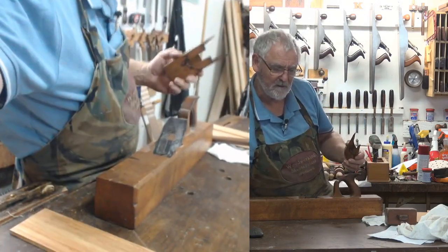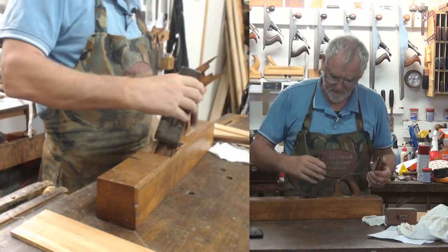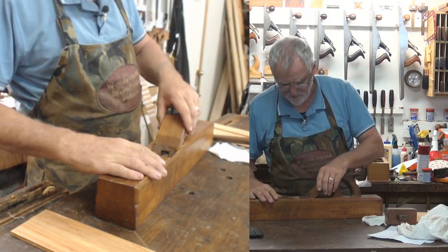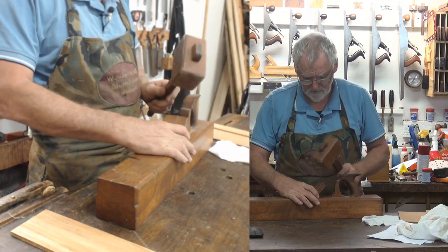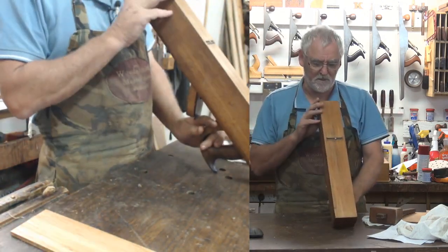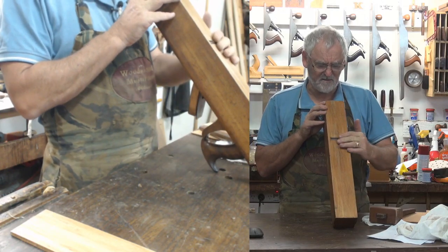Here we go. Put the blade in the throat, put the wedge in, tap it down, have a look, see how much blade's out.